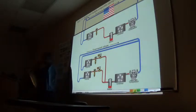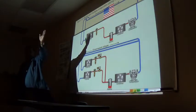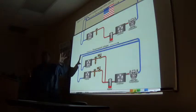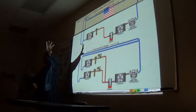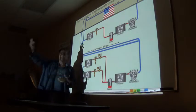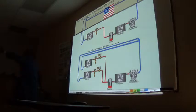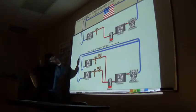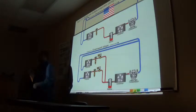And it's interesting if you go into a refrigerated warehouse where they have loading docks. This is how they have it. They have a long line of evaporator units, and all may come off of the same compressor bank or single compressor. Each of them will have their own thermostatically controlled thing, the thermostat right behind it, so that each zone, because each loading dock door will have one of these placed right in front, keeps that section cool while the truck is off-loading and while they're loading again. When they close the door, it shuts off that section when the temperature is satisfied. And eventually, hopefully, you get uniform temperature throughout the dock.